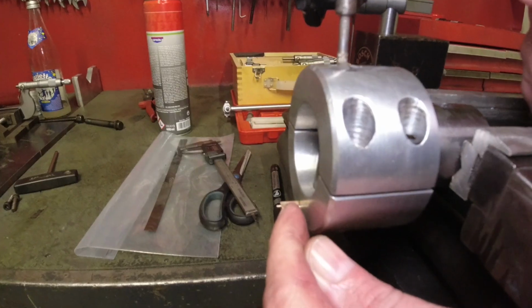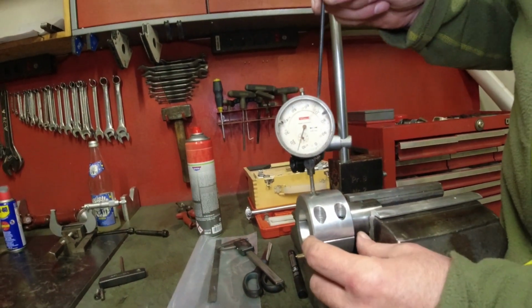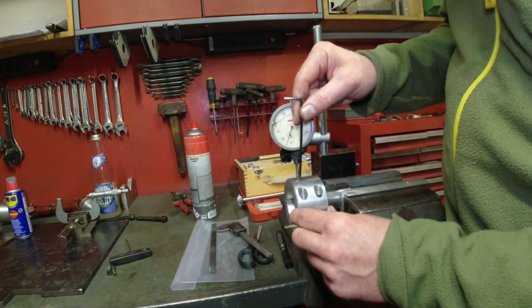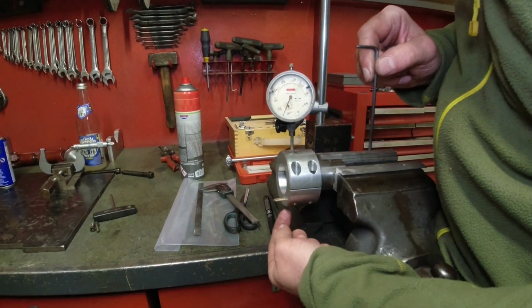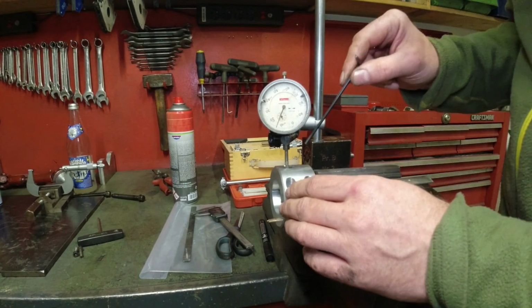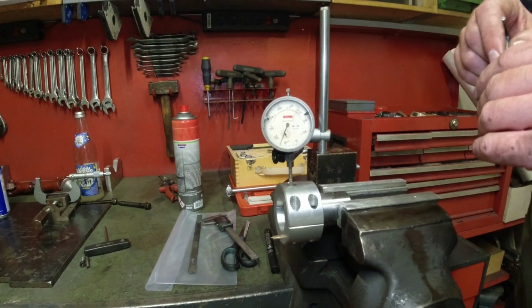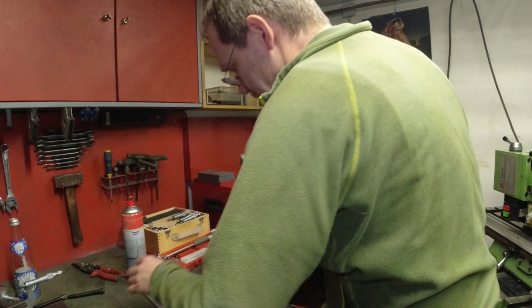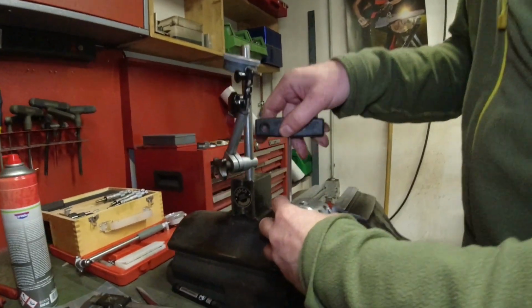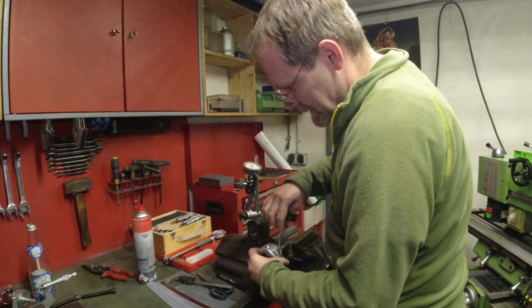It's such a flat taper down here. It is also really solid. So if there is a force acting up on this cutter in this direction, it has a solid backup and not just a set screw. And this makes this a very rigid and fine adjustable cutter. I don't think anybody can reproduce that. Of course they can. Any hobby machinist can reproduce such a cutter setup.